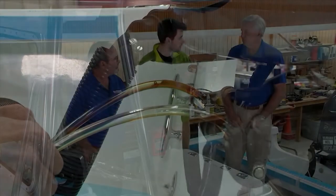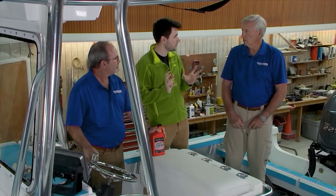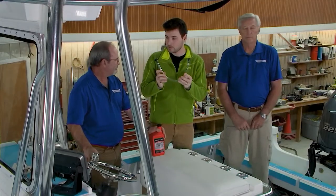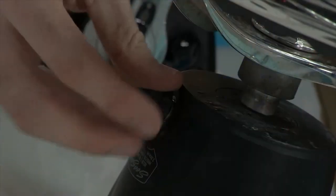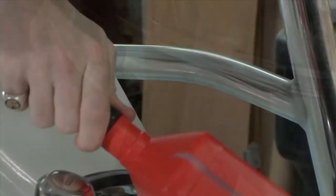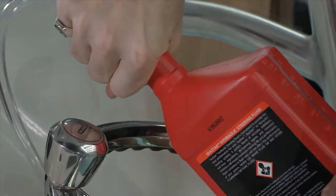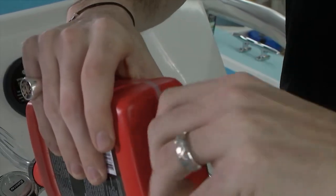Once we've gotten rid of all of that, our system is totally dry. We need to refill it with fresh brand-new oil. There's a kit that Sea Star makes — this is part of it. It's an adapter: this end goes into the fill on your helm, this end screws onto your quart of Sea Star oil. It comes with a punch pin that you punch a hole in the bottom of the bottle, and now you've got it upside down like an IV.